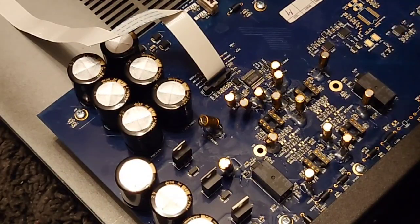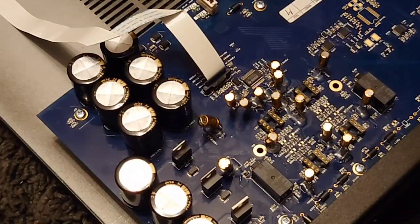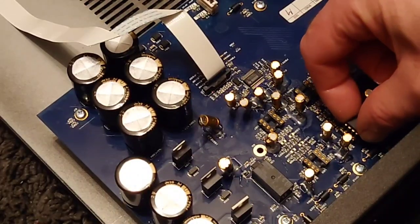I've been running those in for a while, but now I want to fit these op-amps. They have a little circle in the corner on the right-hand side to indicate orientation. Before pushing them in, I want to put a bit of Caig ProGold onto the pins — I've added some ProGold to all the pins and now I'm ready to push them into place.